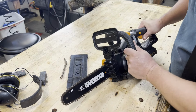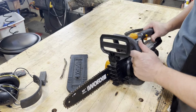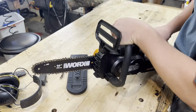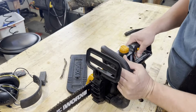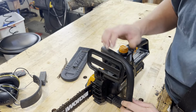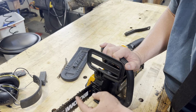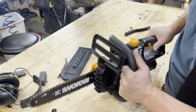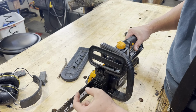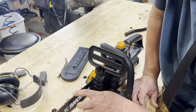Okay, so I've got all my blades ready. I did a total of 13, two of these smaller ones. This is a friend of mine's, just a cheap electric chainsaw. Works pretty good, except the blade pops off sometimes. And also the grind on this from the factory, I think it was less of an angle, and it jumped up and wouldn't cut good. It just kept on jumping around. So my new grind put a little more of an angle on. So I'm gonna try this one first and then we'll try the other ones.